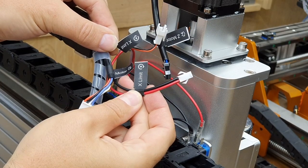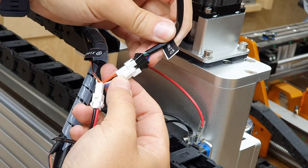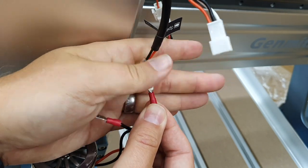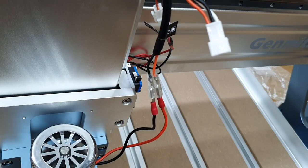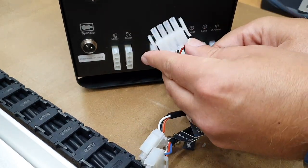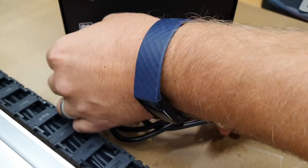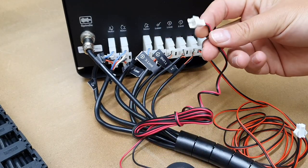It's now time to connect the wiring loom. All cables are labeled to make this easier and have male and female connectors to ensure they go in nice and secure. Connect the limit switches, then connect the stepper motors — these have slightly different connectors, avoiding any confusion. Work your way around the machine ensuring all cables are connected. Before moving on to the spindle spade connectors, push these in firmly and make sure the covers have been slid down over the top of them. On the opposite end of the wiring loom, connect this to the control box — the connectors will only go into each port one way, so just flip them over until they go in and click into place. Once all are connected, connect the spindle, then connect the Z probe — connect the large connector to the back of the control box for the extension, then connect it to the main Z probe itself.